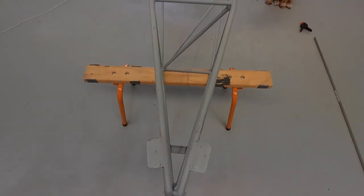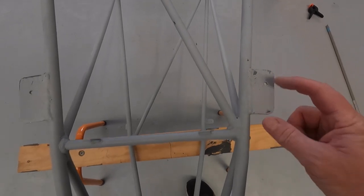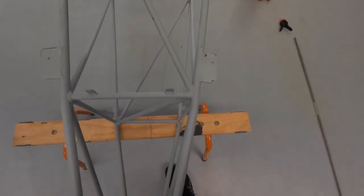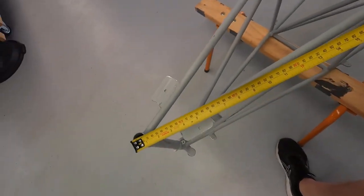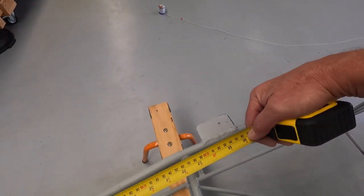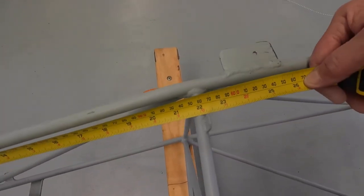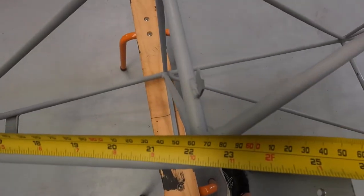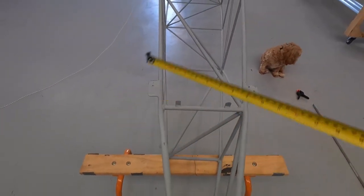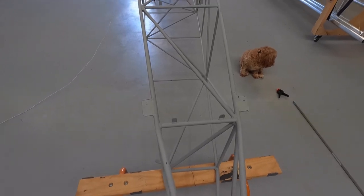I drilled the holes - very nervous doing that. You've got to be careful because this one looks closer to one side than the other. But when you measure from the tail post, that's 40, and this hole is also 40 - 640. If you measure the cross brace, that's 60, and this way it's 70. That's telling me the manufacturer's cross brace is not squared to the datum line, which throws you off a bit. And I mention those tags don't need to be there.